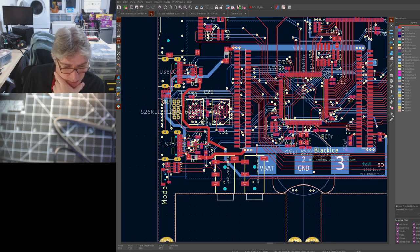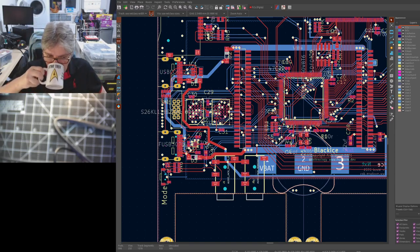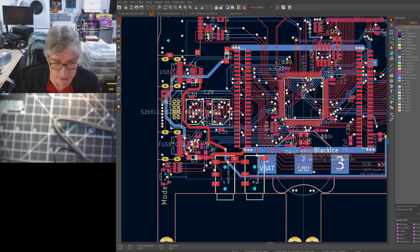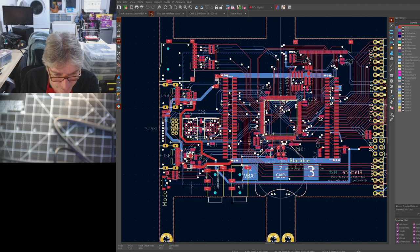So that's what those two are there for. I've added those in because it's a relatively low overhead way of adding that kind of keyboard support. You could alternatively bit bang PS2 very easily using the GPIO pins as well, which is another possibility if you wanted to do that, using those same IO pins.